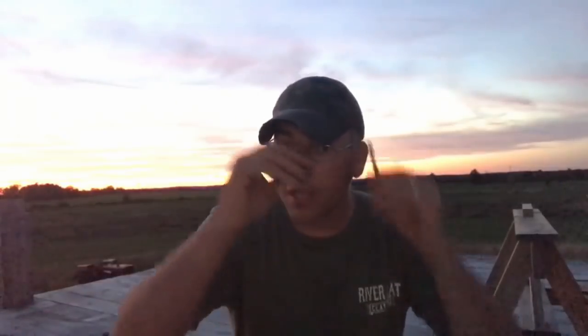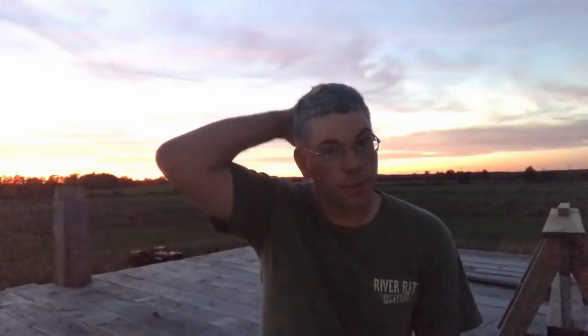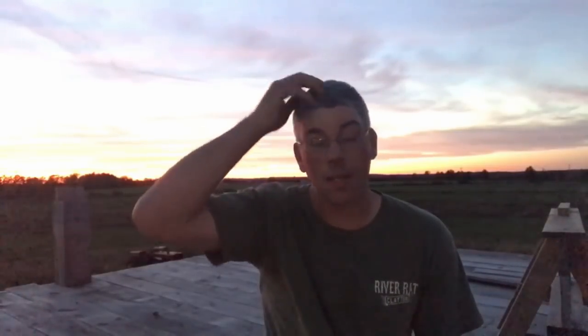We're getting a little dark for the camera again, guys. So another stupid mistake I've made in the course of this frame. What are you going to do, though? You just got to fix it. I can sit here and complain, but it's my own fault for skipping steps that I know better than to skip. So best advice I could give you guys, when you go to throw your top plates on, if you've made a mistake in your wall post heights, really, if you made a mistake in much of anything on that outside wall, your top plates are going to show it.